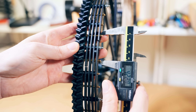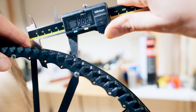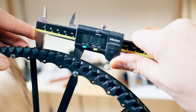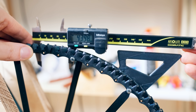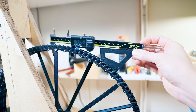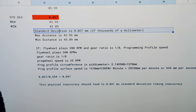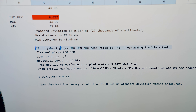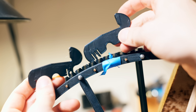Let's measure if this design can play tight music by measuring the distance between the metal bars. When measuring like this, the angle of the caliper affects the measurement a lot, so I printed a dedicated profile that I could click onto the wheel and then rest the caliper on. This gives a consistent measurement, and it turns out that the wheel is super accurate — only 27 thousandths of a millimeter standard deviation across the entire wheel. By calculating the speed of the programming wheel, we can calculate how tight the music would be: the inaccuracy would only induce 0.041 milliseconds of rhythmic error on average. This is tight music.